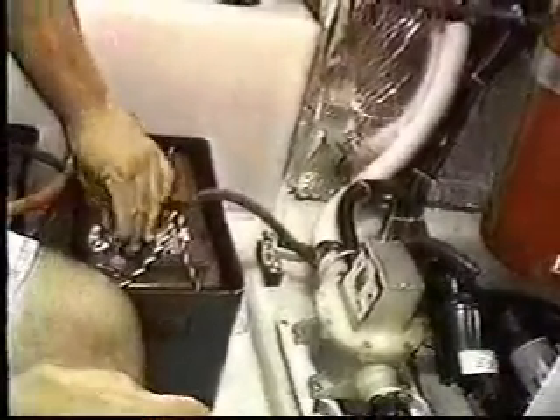We'll run two 12-volt batteries wired in parallel. We've chosen Trojan batteries because they are marine batteries known for their deep-cycle ability, and we need deep-cycling batteries to power this bow thruster. We'll hook up the negative lead, which is a pre-run cable we ran a little earlier, up to the bow thruster area. We're going to mount a fuse holder with an inline 60-amp fuse because the bow thruster motor can pull up to 50 amps. Finally, we connect those battery leads to the motor, and then the cutoff or kill switch.